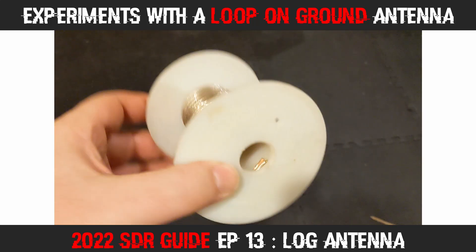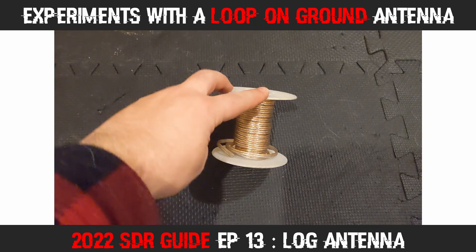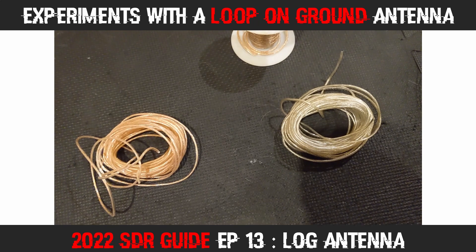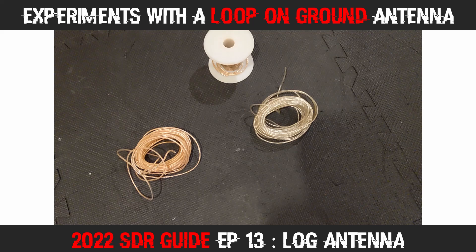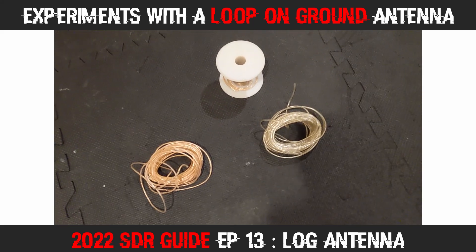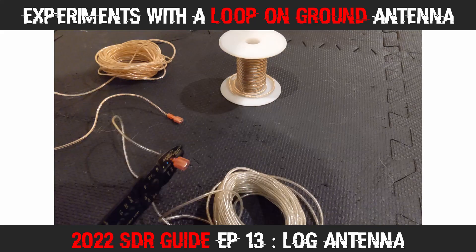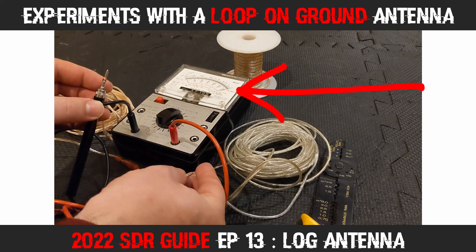I had a spool of speaker wire, so I decided to use that spool. I didn't quite have 60 feet on it, but of course there are two sides, so I just pulled it apart and split the two sides. Now I have 30 feet of the copper and 30 feet of the silver wire, and all I'm going to do is join them together. It's always better to use a single strand of wire for an application like this, but I just had to crimp these two together and try that. With the two ends joined, I tested for continuity before heading outside to install the antenna.